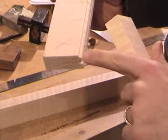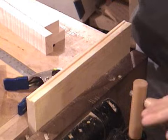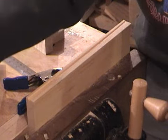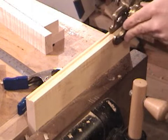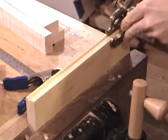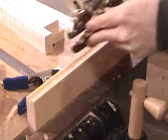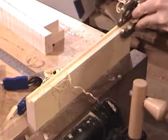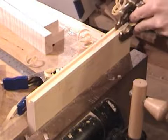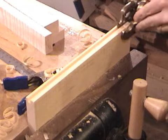The only thing that will be left is to cope around this little bead. To form these rabbets and beads, there are a number of ways to do it. I'll give you a real quick demo on the rabbet. You can use a rabbiting plane — I have this one set up and literally just plow your rabbet. The nice thing about this is that it doesn't make a lot of noise or dust. You can adjust it pass by pass fairly quickly. It's got a depth stop on it. And there we go — now I've plowed the rabbet.